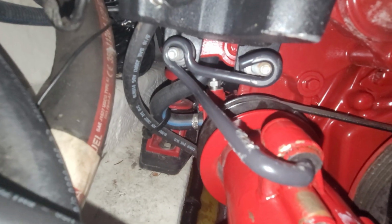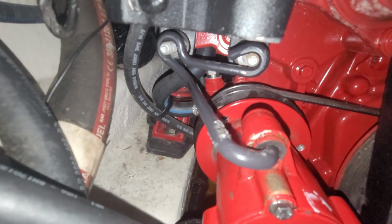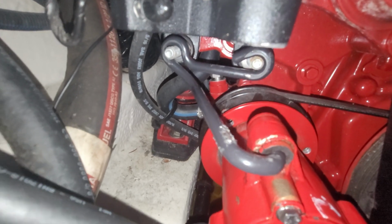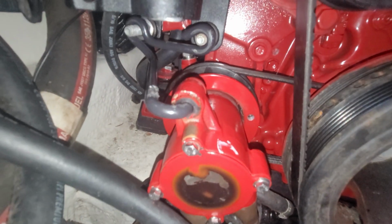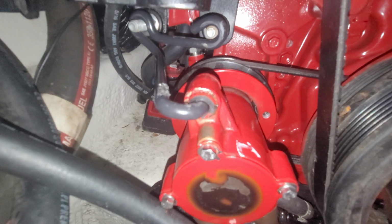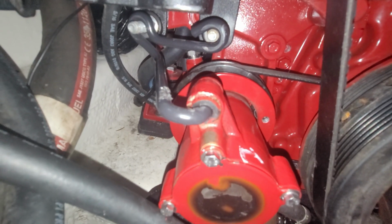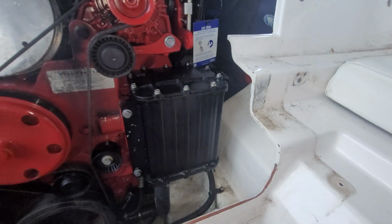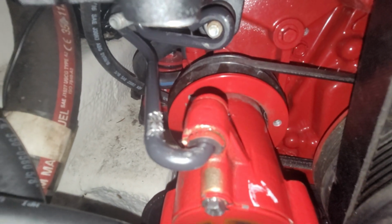What also makes it tricky is those 2 bolts in the back that, with this little retaining post, also have to be lined up. So you have to get those lined up and then that bolt pattern lined up as well. The nice thing about it though is once it's in, you're not going to be searching for the threads like I did with this goddamn heat exchanger, because those little grooves line it up.